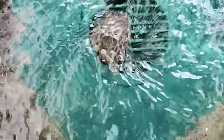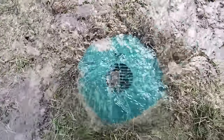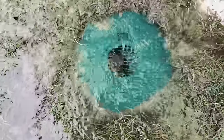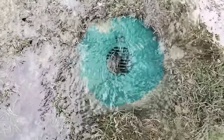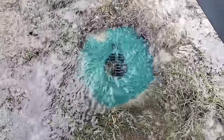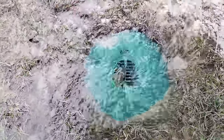Here you can see this water literally creating a funneling effect — it's just grabbing up all the water. Notice how there's a turf restrictor plate around that 4-inch grate. That's so the lawn doesn't grow over that inlet grate. We want this thing waiting and ready for the next rain event. We don't want the grass to grow over it — otherwise you end up with a flooded yard and you're looking for that 4-inch inlet and can't find it.